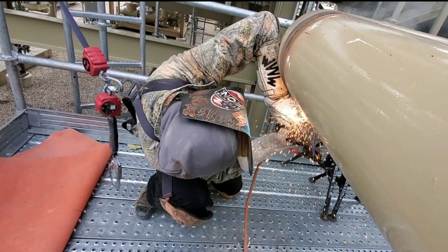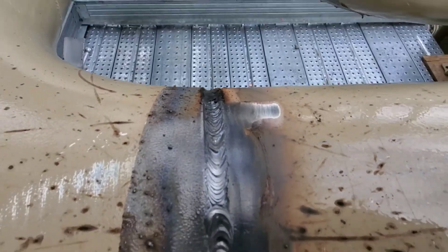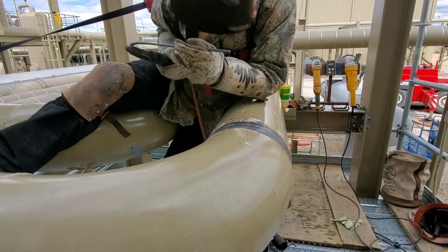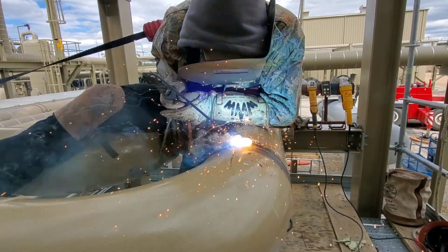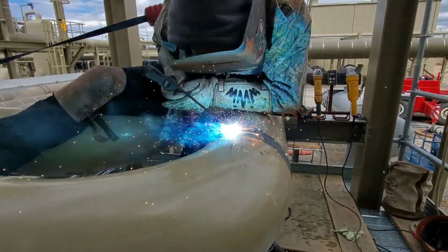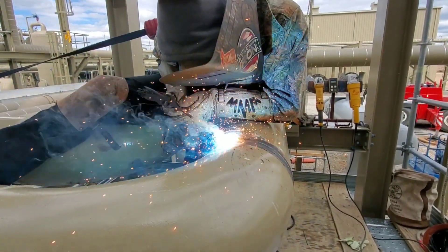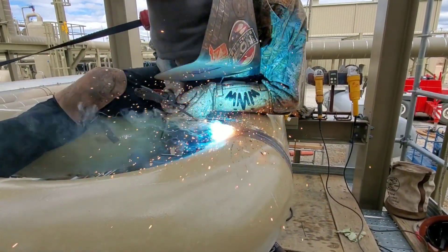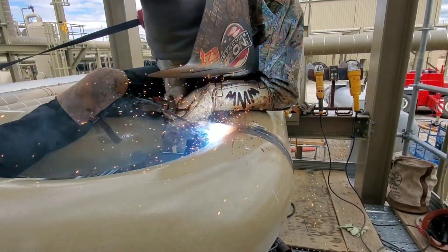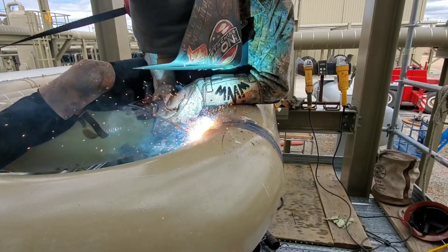This isn't the best fill, but this is a good picture of the fill — at this point I am ready to cap the pipe. I tried to get as comfortable as I could up here because it's not a good position. I'm just making my best to do my best. It's not always easy — sometimes I might make it look easy, but that's just because I've been doing it for quite a while. I've been pipe welding for quite a while in my career and I enjoy what I do. I just love to weld pipe — it's one of my favorite things. Structural is cool, but welding pipe is cooler. Notice my body jolting a little bit — I'm so crammed in that little spot. You've got to make sure you're doing your best to get a good weld, and again stay inside those bevels. The bevels are filled up now but that's still the arc zone.